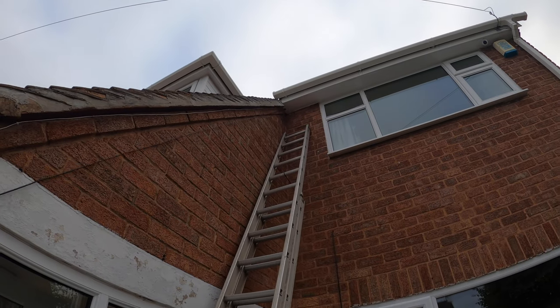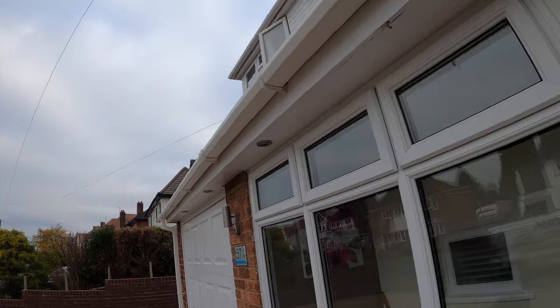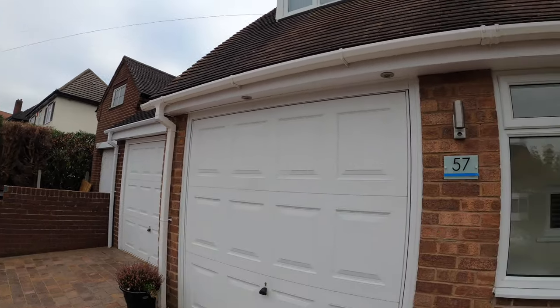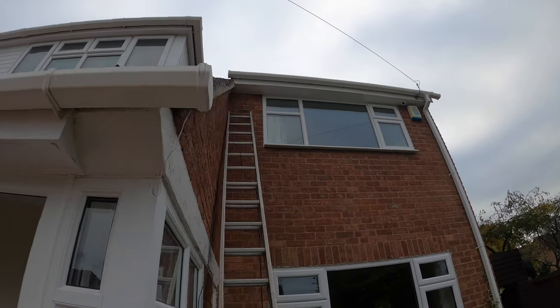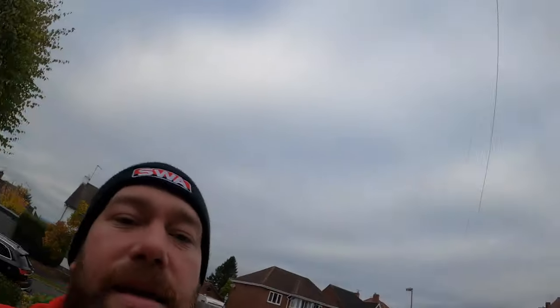Young Scotty's just pulling the second one now, taking it to the loft hatch. I'll leave enough cable to get round the corner and up. Second camera's nearly there. We've clipped all the way down across that face, then took the gutter in off and clipped above it so you can't see any of it. Put the gutter in back. We've popped out and clipped around there. We've got Scott's idea of clipping across the top — took the gutter in down and clipped above, then put it back. We'll probably come down and round or straight over that line and tuck in above there. The camera needs to go there for the best coverage — it'll look sound when it's done.